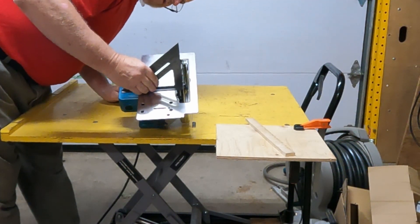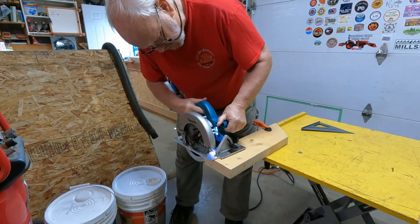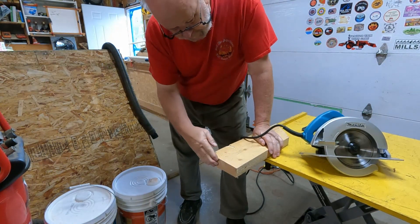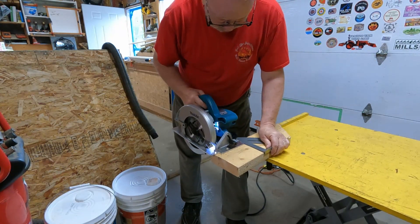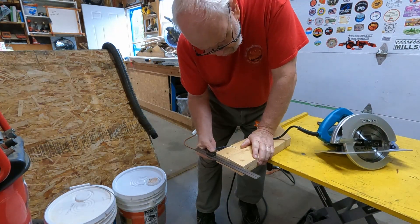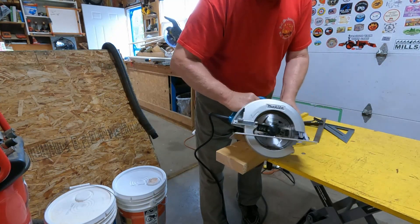Well, it cut like a new saw — there's no two ways about it. I just want to set this shoe down again and see how square this is. Let's unplug it first, because there's no interlock on the blade and I want to unplug it before I get my fingers really close to that blade. Let's see if this is square or not. My god, it's dead on, it looks like to me. I'm going to cut just a piece off the end of it here. It's got a little LED light in here too, I just noticed — that kind of shines down on your work. That's kind of neat. It makes a nice cut. Let's see if I can cut square with it. Nice that way. Pretty nice that way. By golly — I think it's a keeper. I like it.